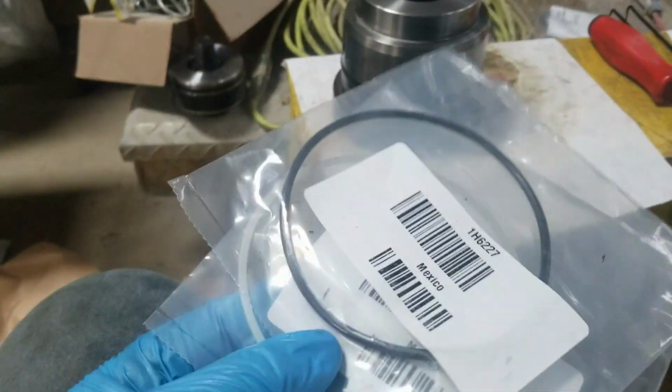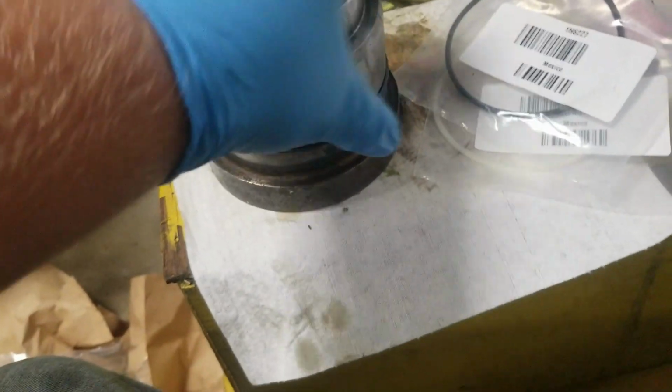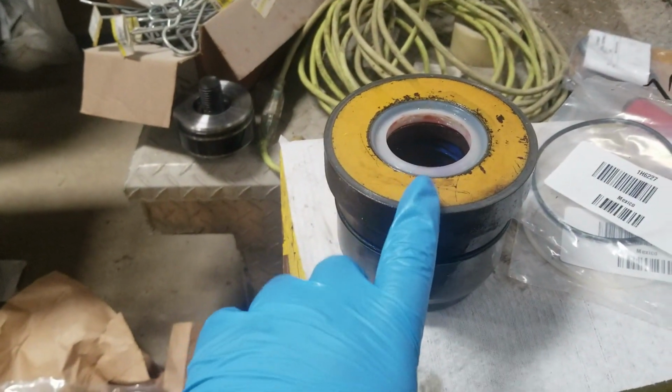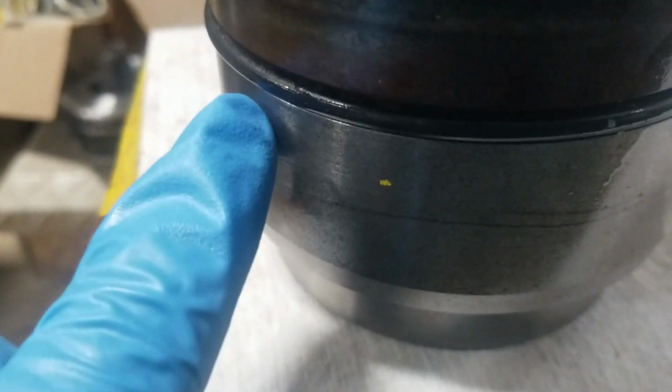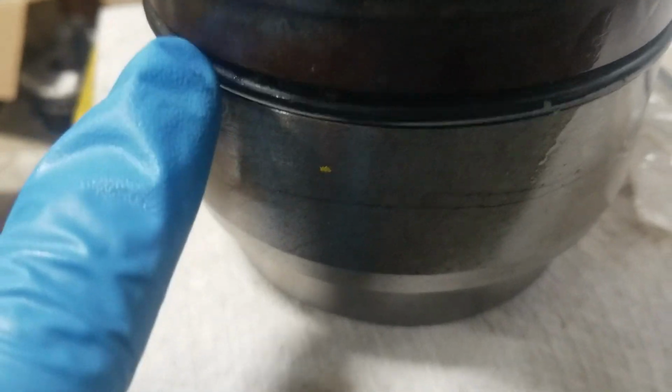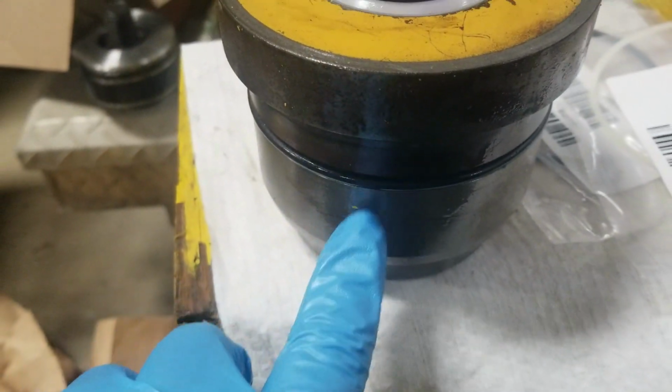You've got O-ring, backup ring. O-ring goes towards the oil. So usually I'm assembling like this, sitting like this, wiper seal oriented up. You would have your O-ring. This is the old one. Obviously, I don't know if it wasn't with it or wasn't on it or deteriorated, but this O-ring would go on, and then you install this nylon, that's the word I was looking for earlier, above it. So when I get it on there, I'll show you what it looks like.